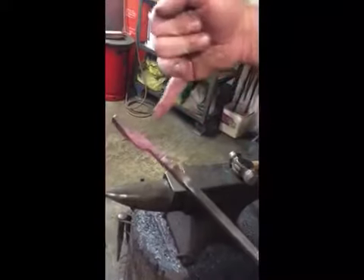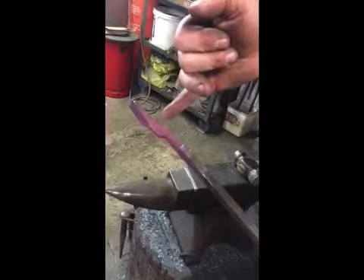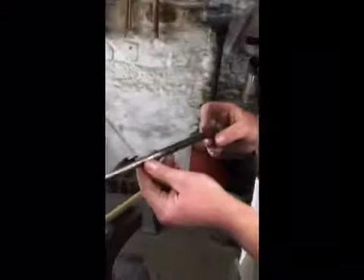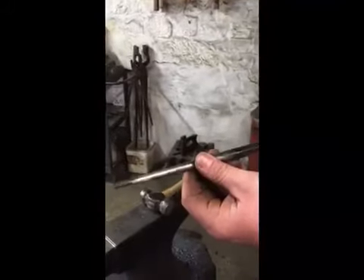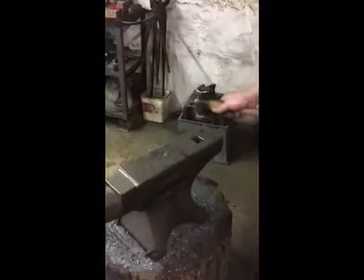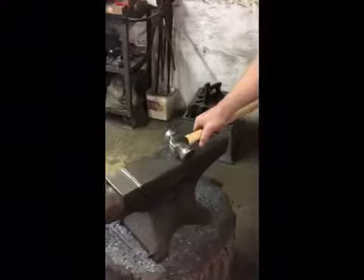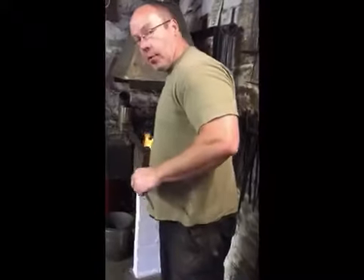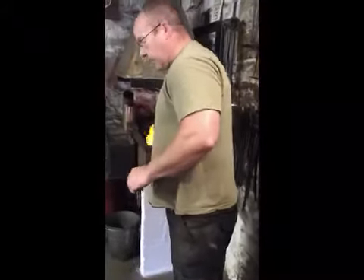So the other bit is the hole for the rivet. Now you would think that would be drilled, but it's not - it's punched, which I shall show you. You can use a tool like this, called a punch or a pritchell if you're being traditional. And you do it at first on the face, and then just as it's about to break through, you switch to the pritchell hole and drive out a little slug. The reason you do it like that is because it doesn't actually remove very much material - you preserve the strength of the steel. Because you're not really taking very much out. If you were drilling it, you'd be taking out a lot of metal.